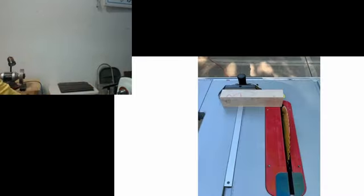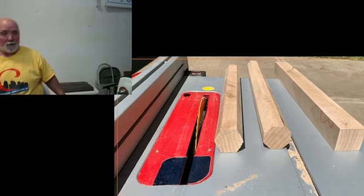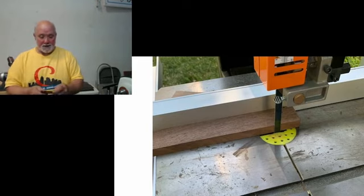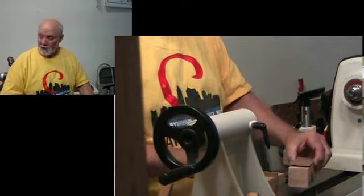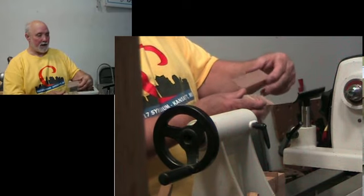But after I get everything squared up, then I want to make my insert pieces. And for that, number 5, please. That's where I've got everything squared up and ready to go. Okay, now number 6. I want the width as close to exact as my piece that I'm making, so that when I put it in, I can actually butt it up against a piece, and I'll show you here in a minute where I glue it up. But I want to be able to set it in, but I still want some sticking out, so I've got something to handle it with.